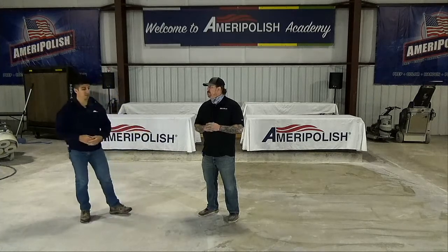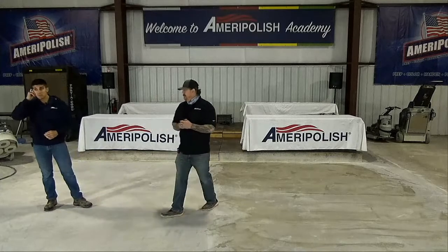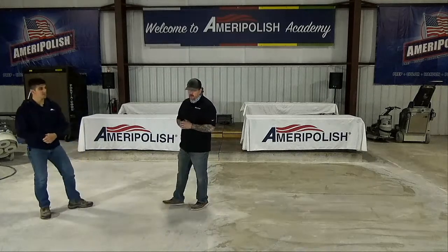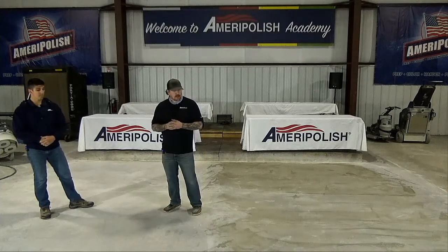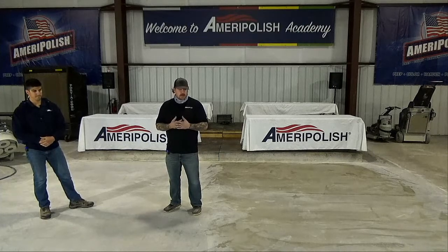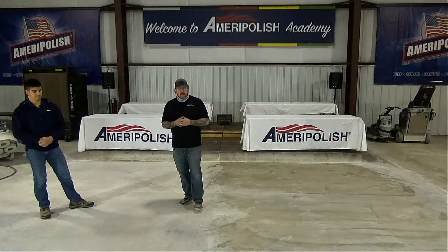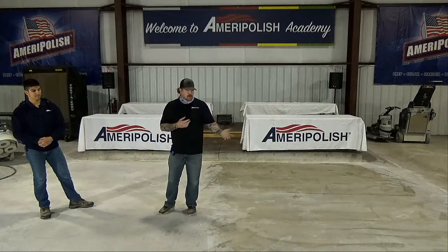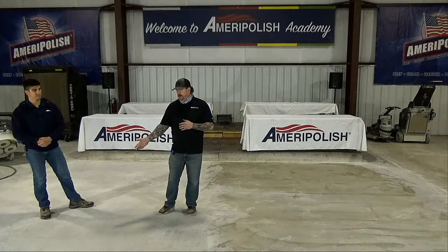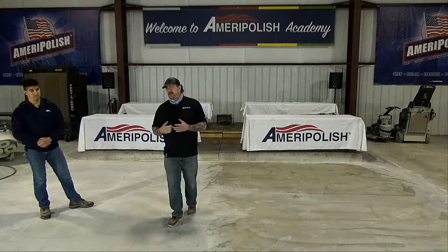Gary, do you want to explain why we did what we did? We're using our SmartFloor refinement system. It is an all wet system, a 5-step system. We prepped this floor: we cut it once to open it up on this side, and this side has our PG7K, so you're not sitting around on the computer watching paint dry. This is cut to a double zero, 1 pass, and we're going to cut this side 1 pass to show you. Then we'll put the PG7K down on this side and continue the process here, just trying to speed up the process for you.